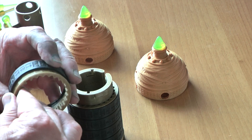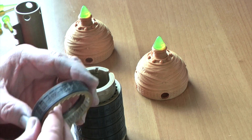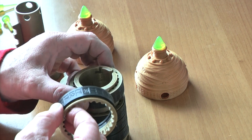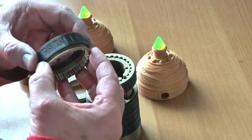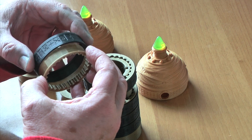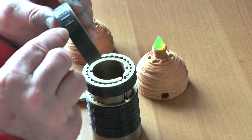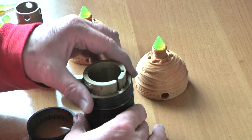The locking tooth - this one has a square cutout compared to the other ones which are round. By moving the ring around, we can change what code comes up. So you can change the code on every ring the same way. Now I'm actually going to put it back to where it was before - that's at the big cross, which you'll find hard to see on here. There's the square - so I need to put the X on the outer ring and line it up with the square on the inner ring, and that gives us our code.